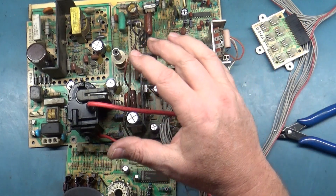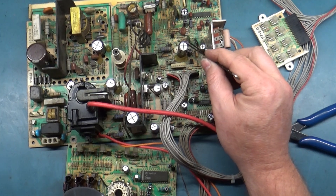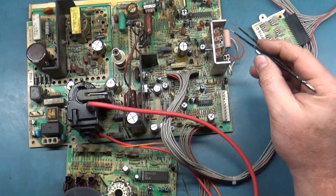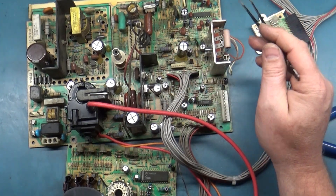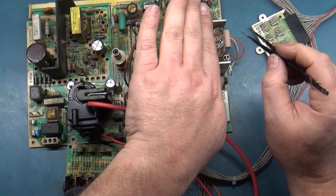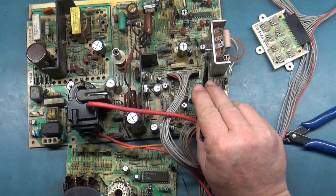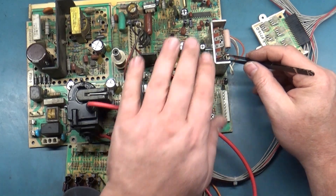On the 2000 and other chassis, there's a 25-volt reference test pin in that area. But on the 5000, it's actually over here because of the vertical sweep mod — you put this connector on the 25-volt reference pin. On the 2000 it's over by the shutdown pot. Because we had our 25-volt reference on the pin, you can pretty much rule out the chassis as a problem — it comes off the flyback, straight through R303, through D302, through some other components that don't cause collapse, over to D603, and right to the vertical IC. So I thought maybe it's a bad cap. I did a full cap kit and full reflow — no suspect pads, no broken pads, no broken traces, no cut traces, nothing was bad, no bad solder joints. Put it back on the tube — still collapsed.